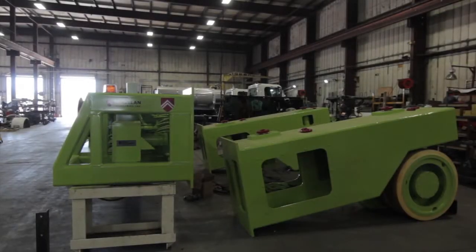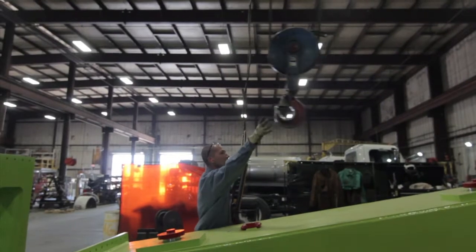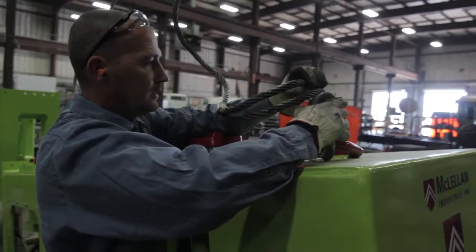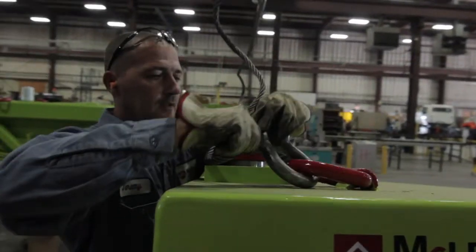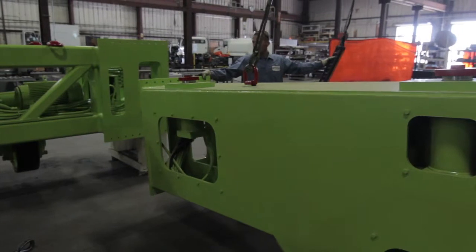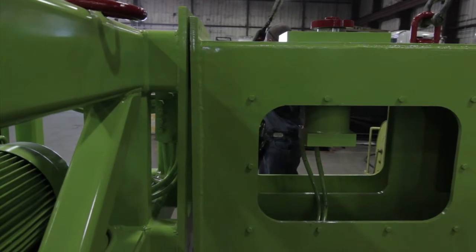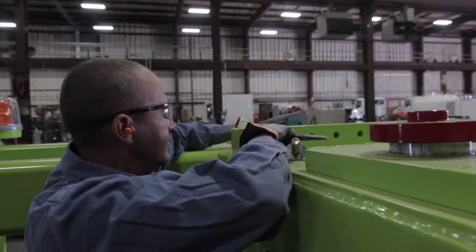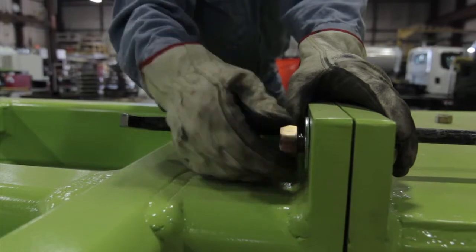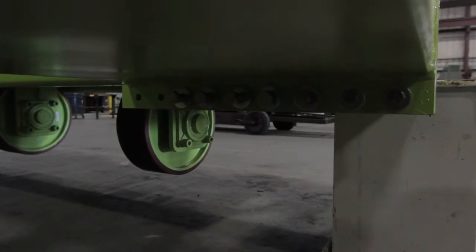The Fichu Transporter is shipped disassembled for easier shipping and lower cost. Using an overhead crane with proper slings and shackles, connect to one leg at a time, being sure that the shackles and slings are connected securely. Lift the leg into place so the two flanges align. Be sure when assembling the legs that the two flanges are flush before applying the fasteners. When bolting the leg on, there are roughly 18 bolts — nine on the top and nine on the bottom flange. Install these bolts, washers, and nuts in alternating holes and secure with a wrench first, then go back and fill in the rest of the holes for safety.